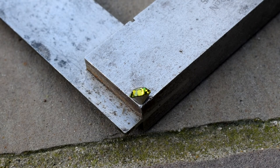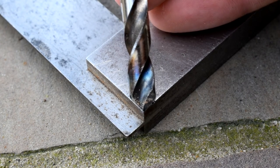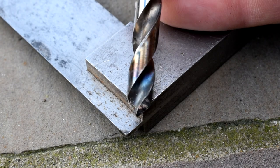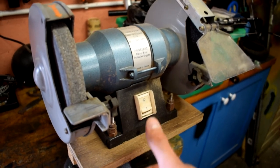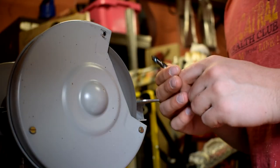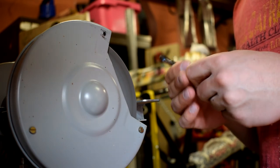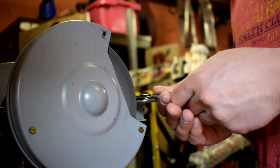The other important thing — which was definitely overlooked by the last person to do this — was that the drill bits should be sharpened to 45 degrees. If you look at the bottom of these gems, you'll see they come together at a 90-degree angle, as you can see on this set square, and the drill bit needs to follow this exact shape. I used a bench grinder to sharpen these drill bits. Sharpening drill bits is a skill I'm not great at, but for this purpose the drill bits didn't actually need to be that sharp because it was a really soft wood material I was drilling into. Checking the drill bit against a set square gets it to a rough 45 degrees — good enough for my purposes.